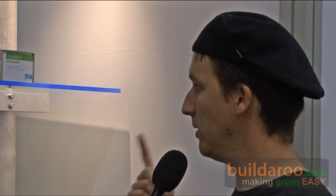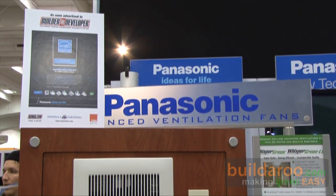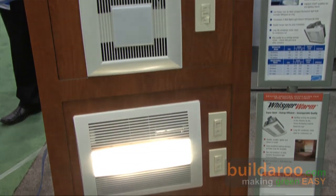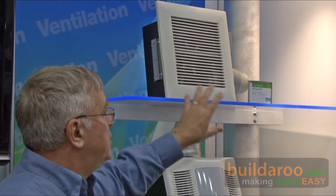So you have a line of these products. What are the differences between them? We have single-speed fans in DC and also multi-speed — four, five, or six speed. We have four different levels of fans within the Panasonic fan families. There's the Whisper Value, intended to fit into a two-by-four wall depth because it's shallow. It tends to be a little noisier — about 0.8 sones to get that kind of airflow. Then there's the Whisper Fit, which is five and a half inches deep so it fits in a two-by-six, and it's a little quieter.